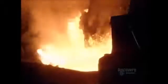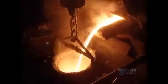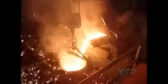In the furnace, the metal's impurities — called slag — rise to the surface. Workers use giant paddles to skim it off. Once the lab analyzes and approves a sample, they transfer the molten metal by ladle to a 30-ton holding furnace.